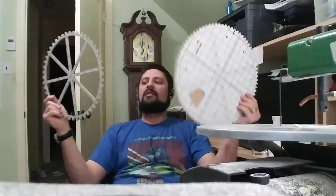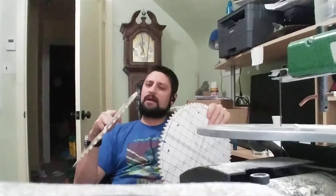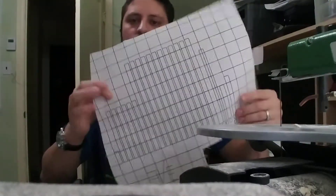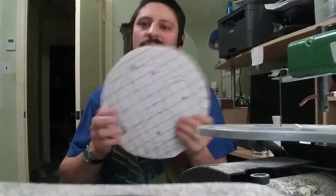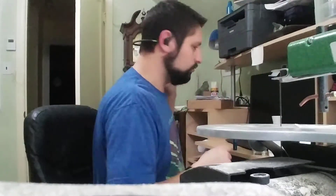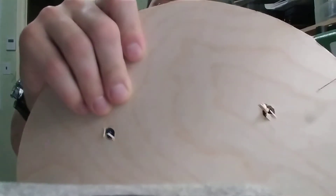I'm talking about this wooden clock. These videos are the manual — if you get a hold of the plans I made for this and want to make your own, this is the manual. So in broad steps: you get the plans — we're talking a huge roll of paper, like 19 feet by 3 feet, with all the parts printed out on them. You cut those parts out and glue them onto wood. Then drill out the holes first — cut out the broad sections with a jigsaw, then cut out the holes. When you cut the holes you want to have a scrap piece of wood underneath, otherwise you get what I call hole blowout.